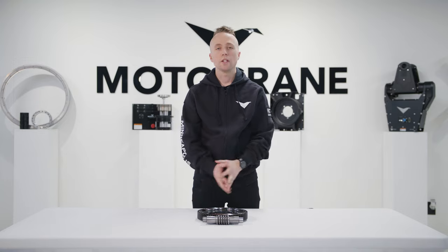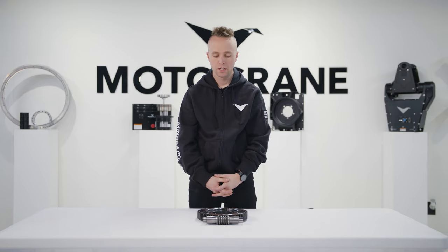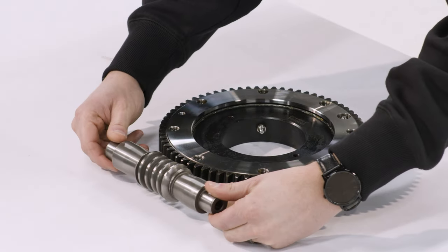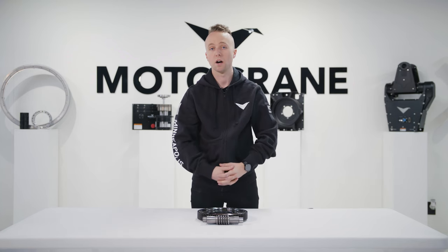So let's rewind to 2018 when we were designing Ultra and our state-of-the-art swing axis technology was this worm drive that you see here. How it works is the swing motor would lay sideways and make this worm gear rotate, which causes the outer race of the slewing drive to rotate — and that becomes the rotation of the swing axis.